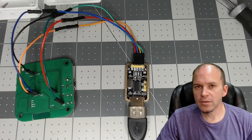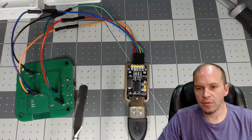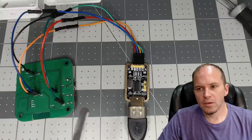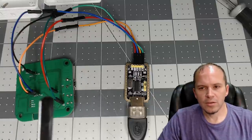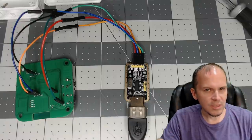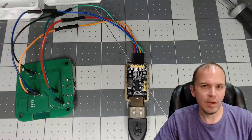Once you've got all your wires hooked up, verify again that you are using 3.3 volts on your particular flasher. Remember: RX goes to TX and TX goes to RX. We have all the wires hooked up. I don't have it plugged in yet because I like to do a little test to make sure I have the correct COM port.